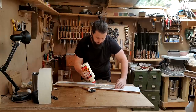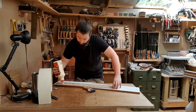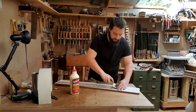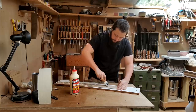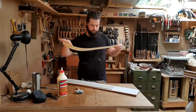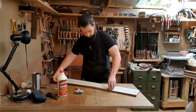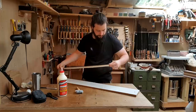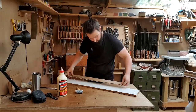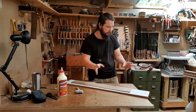Just apply not too much glue, because wood glue has water in it which will actually cause the veneer to curl up. I'm going to position this just so, so on the top edge I can see a very small border of maple the whole way around. Push down, and yeah, it's already starting to curl up.